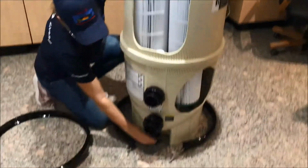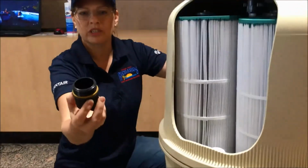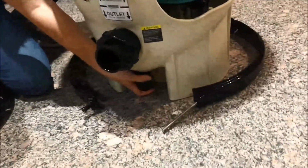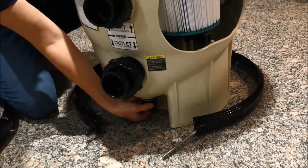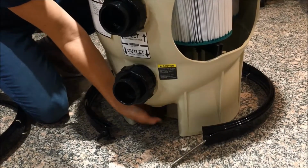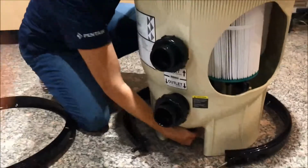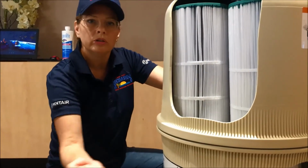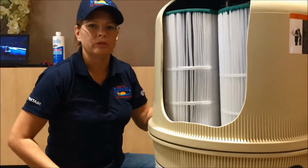You still have to make sure that the water, again, will stay inside here. So your drain is going to need to be put back on. And of course you have lubed that O-ring. Remember that because you're screwing this in upside down, it'll feel kind of counterclockwise from the overhead. It'll feel like you're doing it the opposite, but you'll be screwing that down. If you hand tighten it and give it a good push, that's good enough. You don't have to use a wrench on it, but if you want to, just be light with it and, you know, give it a push, but it doesn't need to be over tightened.